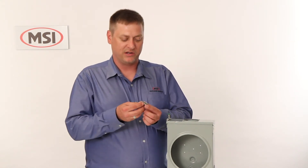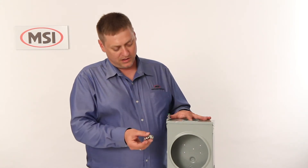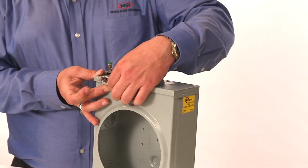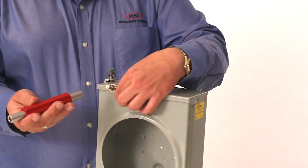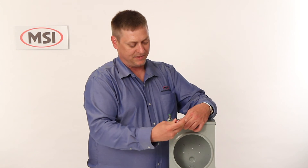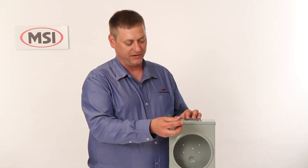I'm going to go ahead and show you how to install the 2167C low profile. What you want to do is go ahead and stick it under the front lip of the clamp. Make sure that you press it all the way up. Again, using single tool installation, you're going to use a 7/16 to tighten it down. It's going to cut through the paint and seal at the same time. And then again, up to a number six ground wire using the 3/8.